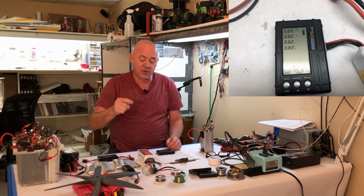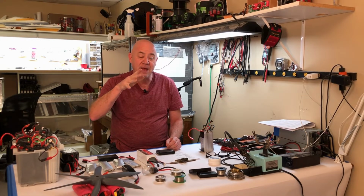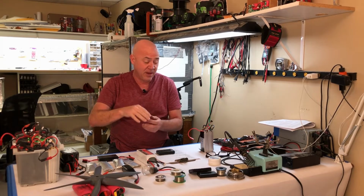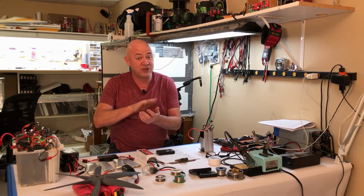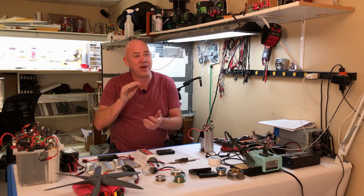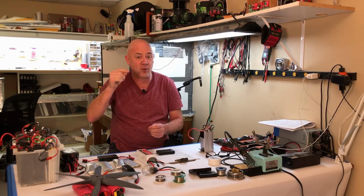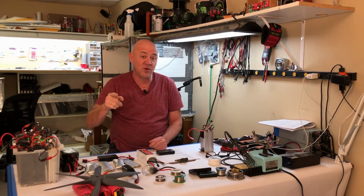Now, what most people don't realize is the higher the capacity of the battery, the more that the charge balance will go out. I mean, more of the balance will go out when it's depleted, when you run the battery down. Your charger will do the best when it's balancing while it's charging, but it doesn't get them all exactly perfect, because sometimes it will stop charging before it forces some of them to get to 4.2 volts. It might be that those cells can't get to 4.2 volts just because they're tired or they're older or there's something going on in your battery.